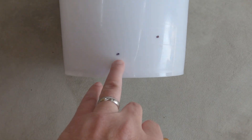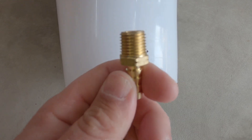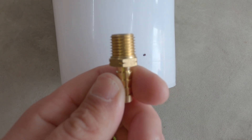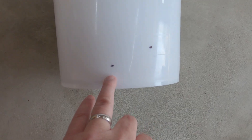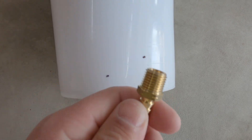I've also marked a couple other spots here off the side. This is where I'm going to be putting my sight glass so we can monitor the level of the water in the bucket at all times. For this hole down here we're going to try to drill this with a 7/16ths drill bit. The outside of the threads on this is about a half inch, so I'm hoping if I drill this 7/16ths we should be able to just thread this in. If not we may have to heat this up just a little bit and screw it in before we seal it.